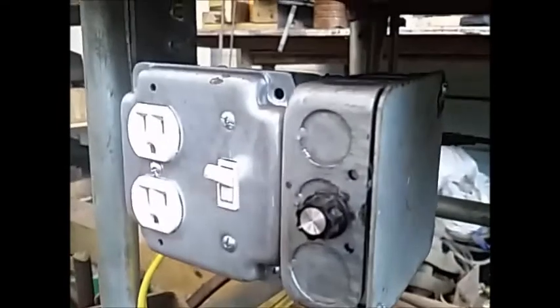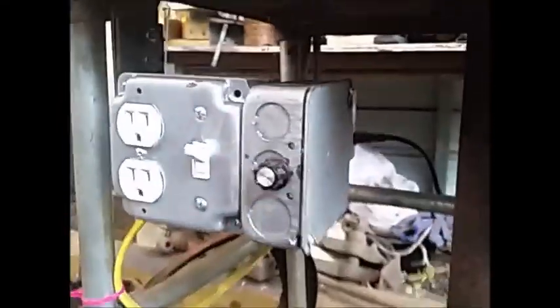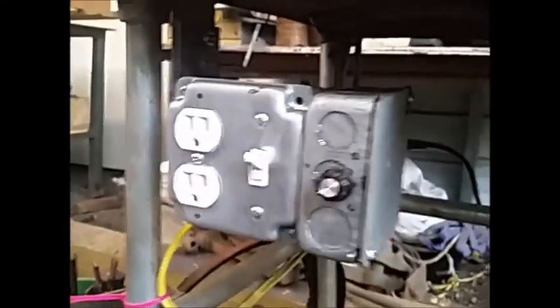That square tubing is our gate valve. There's a little catch there where it's full on — it's got a little stop, you can hear it. That's full — there's no air from the fan going to the forge. Adjustable. That plus the rheostat, so if you're working on some little bitty stuff, you can adjust the rheostat down and then open and close this whenever you're not busy.